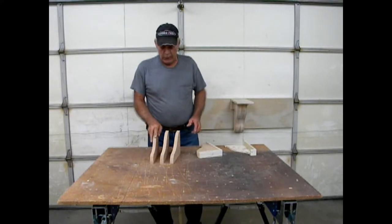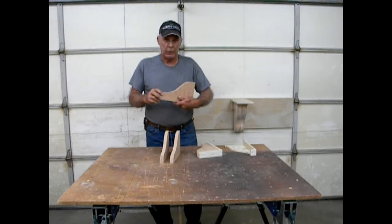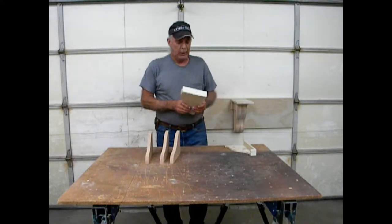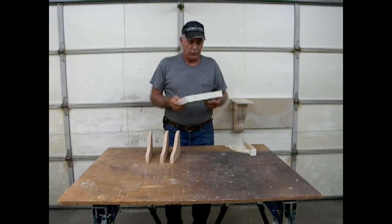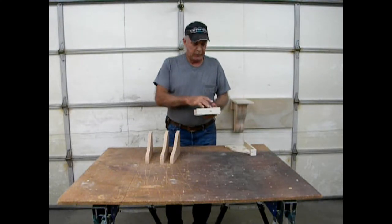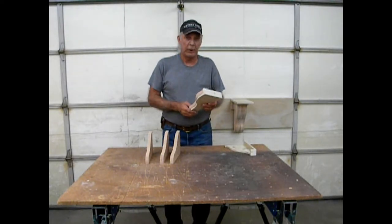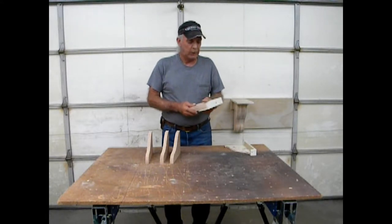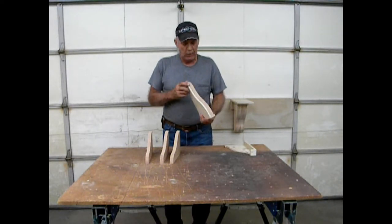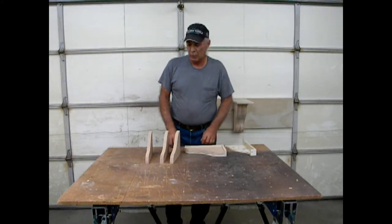I've got my four blanks cut — I used a miter saw to square up the ends and a band saw to cut my profiles. I've mounted my first corbel piece in the sled using three screws to hold the blank securely so it's indexed identically every time. When we go to put them all together the profile will be very smooth with very little sanding needed on the exterior. I'll run all four pieces through the shaper and then continue on with creating the cavity inside the corbel for the handgun.